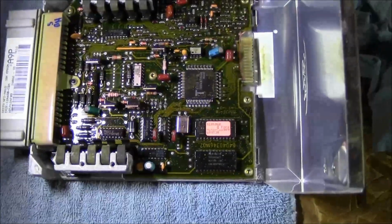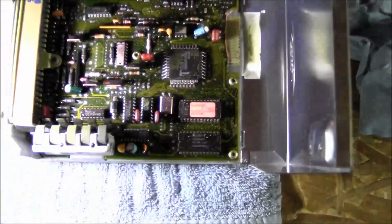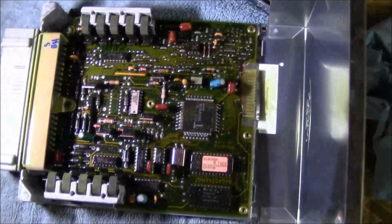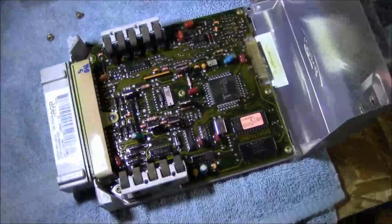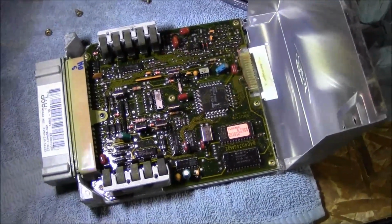And the other thing is, even if you open up your computer and they're fine, you should probably just go get them swapped out. Because if these capacitors start leaking and they damage the board, you're pretty much looking at getting another computer. So it seems like it's money well spent to do something preemptive to prevent damaging your computer down the road.